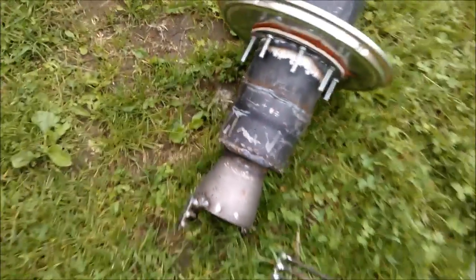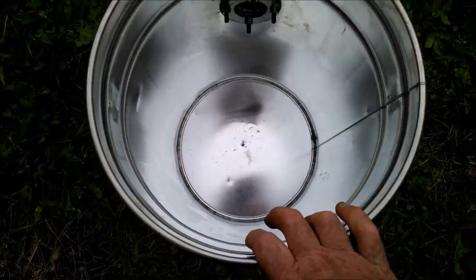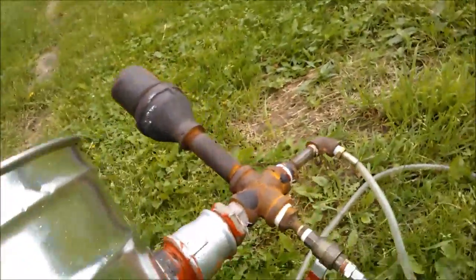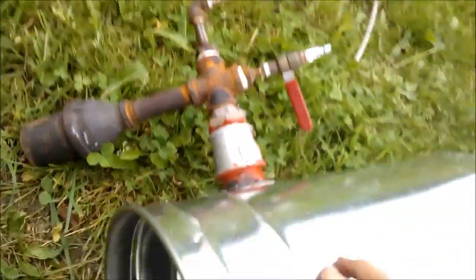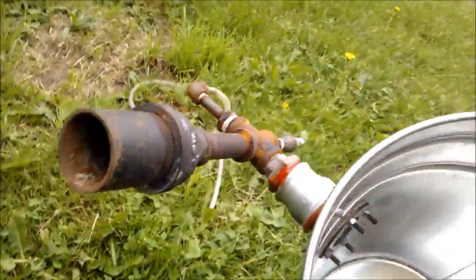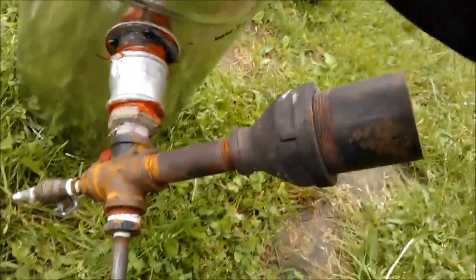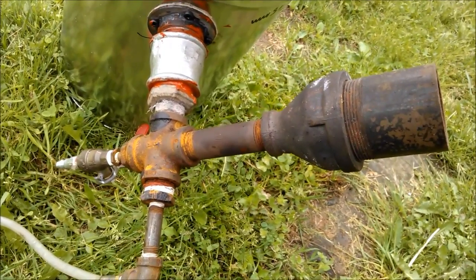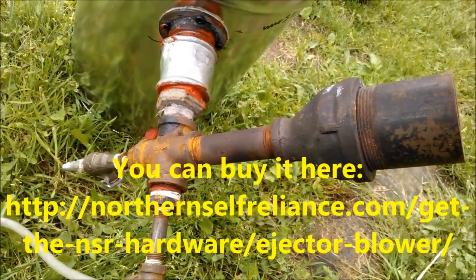Now the second part. This is the actual fuel tube, the burning chamber, the reduction zone, and the grate. The second part is where the gas escapes — through this ring again. Here it is better done: you have a ring inside, a ring outside, with welded thread and then the ejector on it. For newcomers and first starters, I propose don't make life difficult. Start with something useful to exit your gas — a very useful thing is the ejector made by Steven Zabades from the Yahoo Woodgas group.